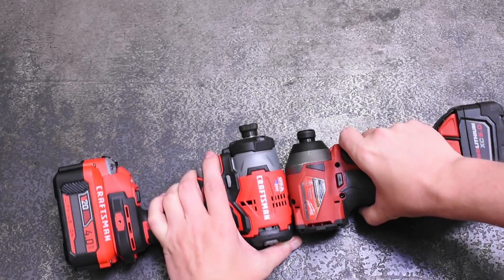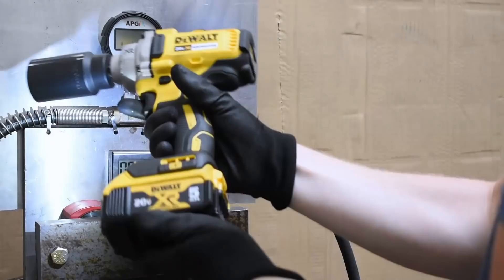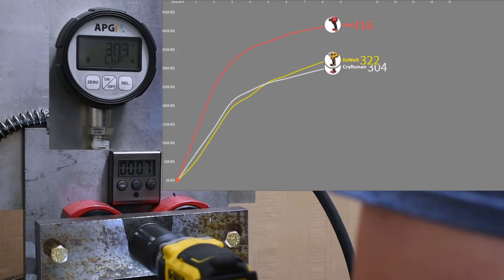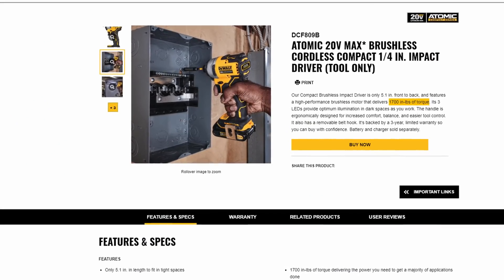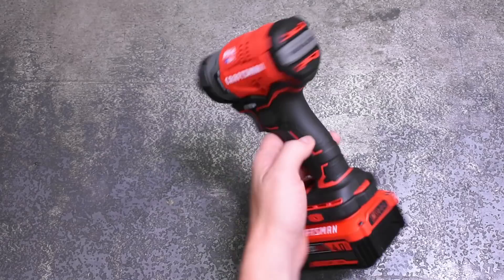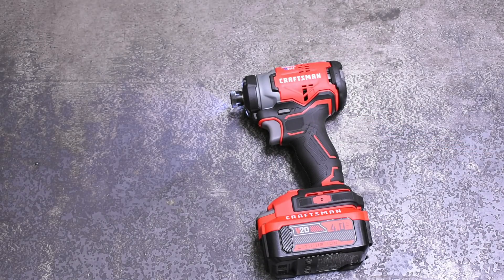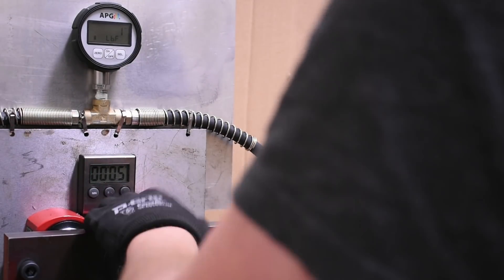We've had a lot of luck with Craftsman impacts over at the TTC shop. The last one we showed on this channel appears to perform like a DeWalt mid-torque in red clothing for less money, and we've seen more supporting evidence recently that this trend is continuing. So is this just something like a DCF809B in a different color? We don't know yet for sure, but we can tell you how many beans it puts down. Let's head over to the dyno for our first test of three: working torque, five seconds in forward. The 167 foot-pound rated M18 2853-20 is up first.